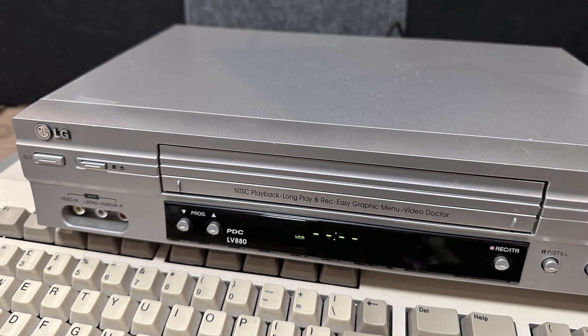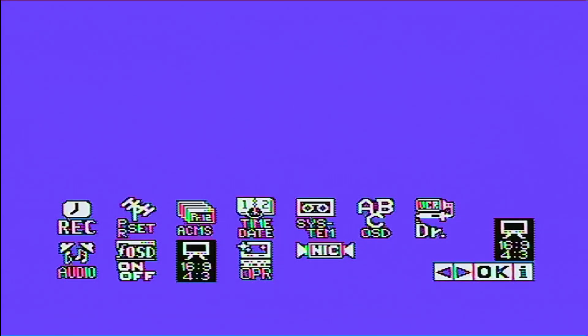To get a better analysis of this, I need to record the signals more directly from both of these modulators. This is much more tricky these days because it's not that easy to get an analog TV tuner card for a modern PC at an affordable price. However, there's another way. I was going to use a VCR, but the output from it is less than perfect and I really don't think it's going to help us very much here. It insists on outputting on a channel very close to what the modulators are outputting on, causing even more interference, and the VCR has absolutely no options to retune that. So I've managed to get one of these — a WinTV USB stick that actually supports analog TV, so I'm going to see if I can tune it in directly, and this should hopefully give the best representation of the video signals from both devices.